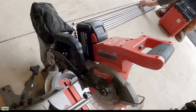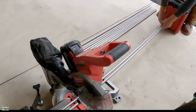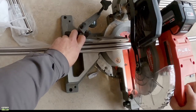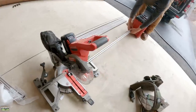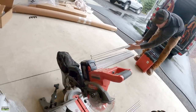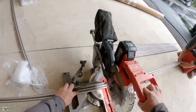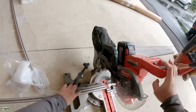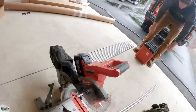Because this was such a small job, I used our little Milwaukee cordless sliding compound miter saw — it's a seven and a quarter inch blade. I used the Pack-Out on the right as a stop so I could cut the tubes to length. This stainless steel Diablo blade does an outstanding job of cutting the tube without burning it or leaving little frays. It was perfect — such a good solution, nice and fast. I decided to cut two at a time; I felt like I could control that, hold them steady, and it wasn't difficult for the blade.